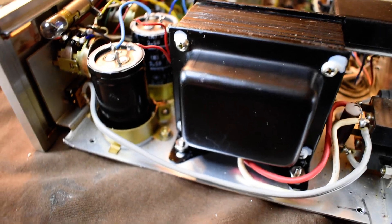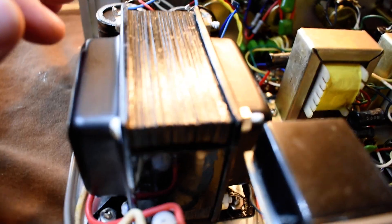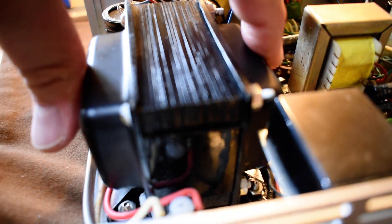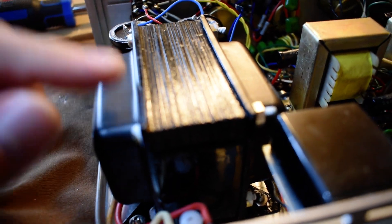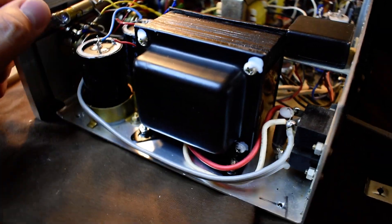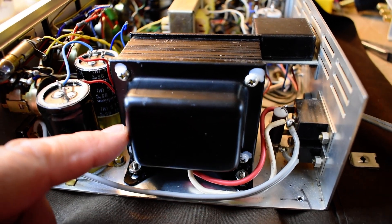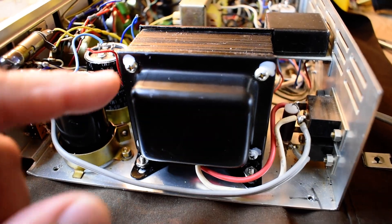So then I thought, I know what it is. See there's four through-bolts that basically hold — here's the iron core, and then you have these two end caps. This is a series of plates put together, and every one of them was loose — like seriously loose, finger tight at best. So I tightened everything up. And just like it originally had — you wonder why are those little dots of paint on there? Because these originally had that as an inspection mark. So if they're there and the thing's in nice shape, I put them back, just with some white nail polish. It kind of has a nice touch.